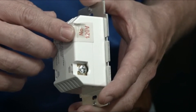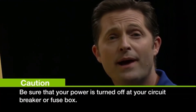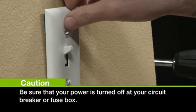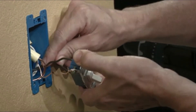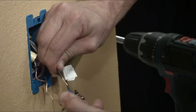If you're not installing the switch in a three or four-way installation, be sure to leave the insulation tape on the terminal. The first step is to shut the power to the circuit off at the circuit box or fuse box. Remove the wall plate, then remove the mounting screws. Carefully remove the switch, making sure you don't disconnect the wires. You should see three terminals: line, load, and ground. Label all of those wires. Once labeled, carefully remove the wires from the device. If they're plugged into the back, just turn them back and forth and they'll pop out.